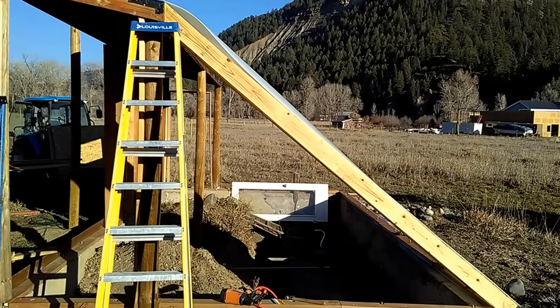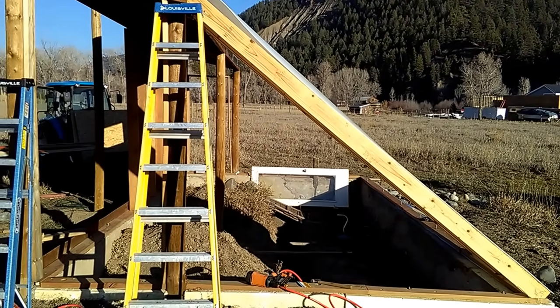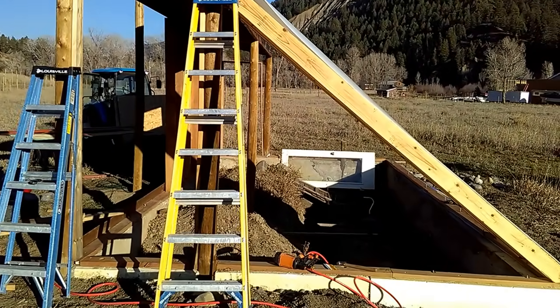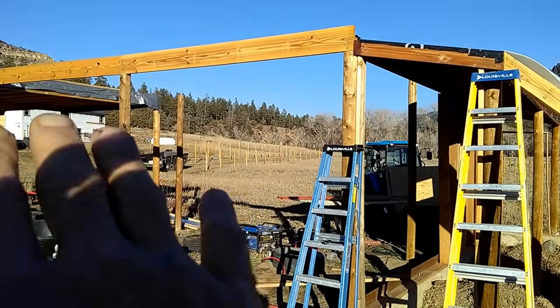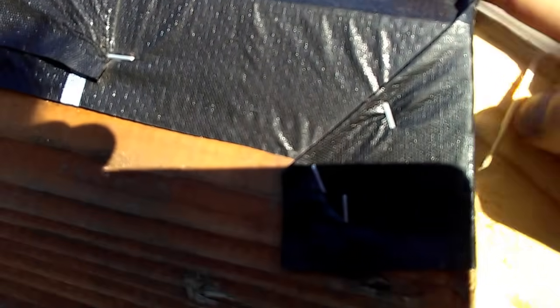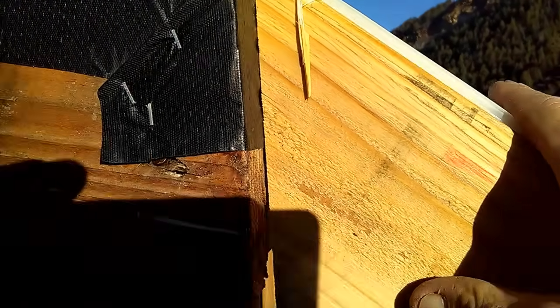Our purpose for this is to have this greenhouse always above freezing — this is going to be our zone 11 or 12 greenhouse, like living in South Carolina. It will enable us to grow all year-round greens, max it out in the winter for food production for us, neighbors, and anyone else who wants to enjoy the bounty. While we're milling here we can just come over into the greenhouse and get a snack or stay warm. You want to make sure the glazing comes all the way up to the lip of your roof tight, so the roofing can overlap at least two inches — everything gets shed off and you don't have any leakage.